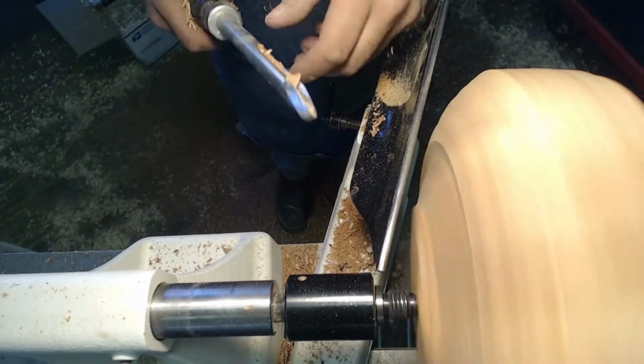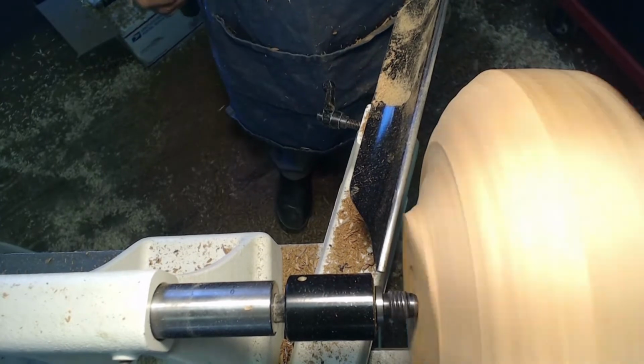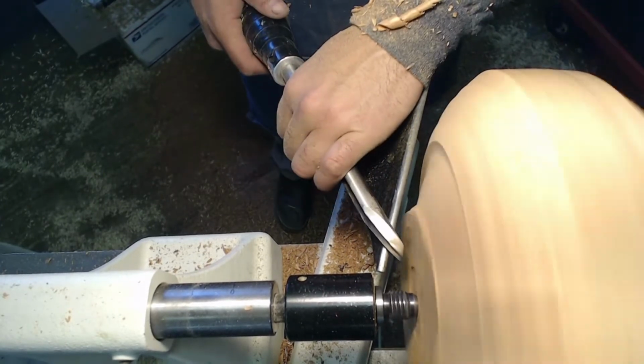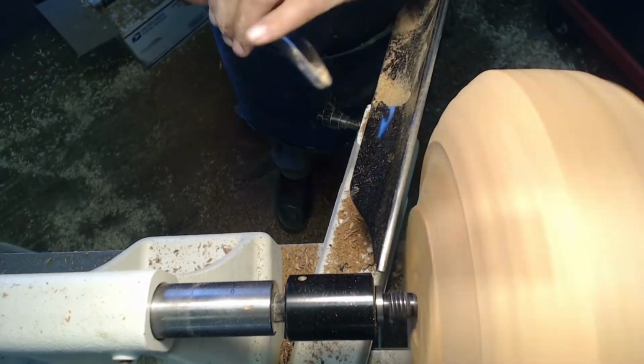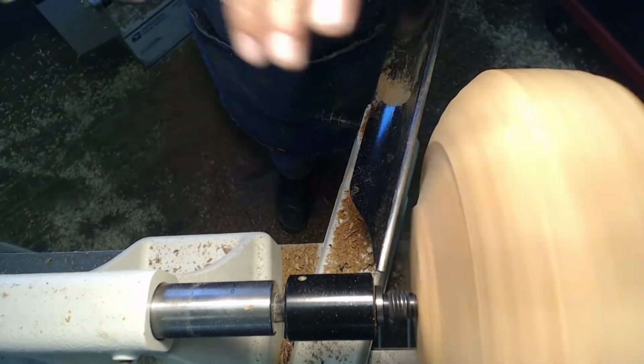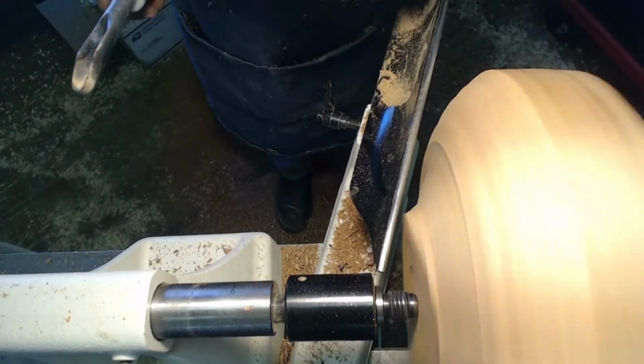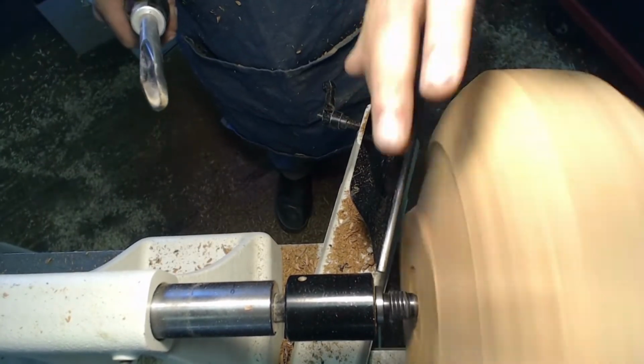do, when I'm facing undulated material, very undulated material right here, what I don't want to do is this. I don't want to actually take this in here and push harder against that. What I want to do is absorb the cut with the bar stock, and that's sufficient for this. So using a 3/8 isn't really sufficient. It's better to use 1/2 inch or 5/8 when I'm roughing out an exterior like this.